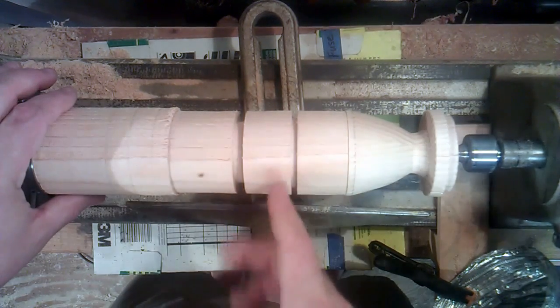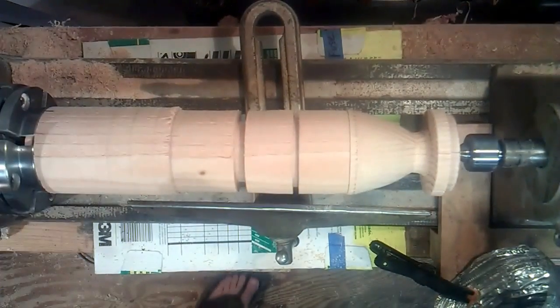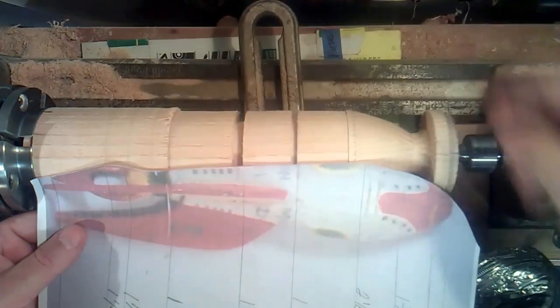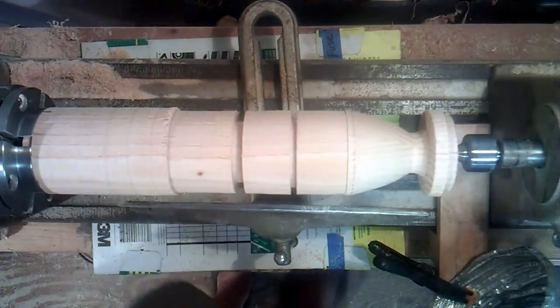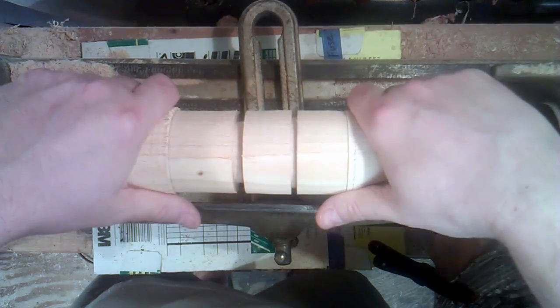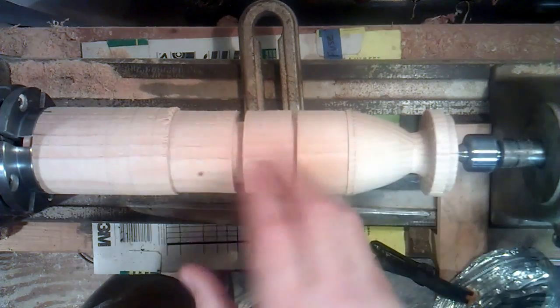What I've done during this project is take my parting tool and cut down to a depth, using my calipers to gauge that depth. I've made myself a little plan based on a picture of an old vintage wood rocket that I found. For example, this depth here is one and three quarters, this is one and a half, and this will be one inch. All I need to do is cut down with the parting tool to that depth, cut off the waste, and then blend the whole thing in. I could do it by eye — I might even do better by eye — but this method works really well for me when I'm trying to replicate a shape.